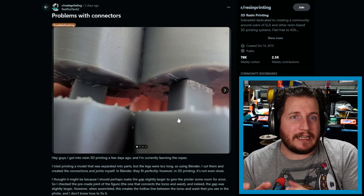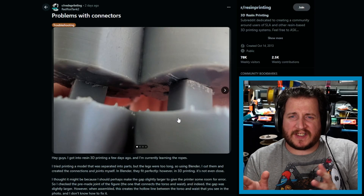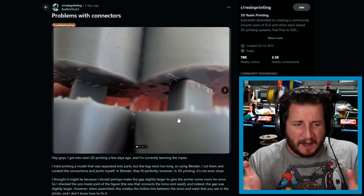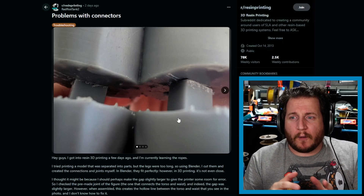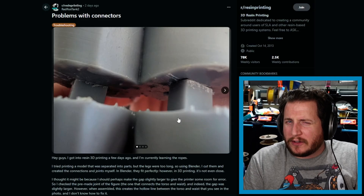When it comes to dealing with interactions of a mortise and tenon — which is what we see here in this failure — you want to have, for resin parts, 50 microns at the minimum; 100 microns is pretty safe. For FDM, you can dial it in, but traditionally a quarter of a millimeter is about all you'll need. If you run fast prints, you'll often need to add more tolerance — going from 0.25mm to maybe 0.3, 0.35, or even 0.4mm to get pieces to fit properly. It is much easier to fill extra area with super glue and baking soda than to have to sand something down.